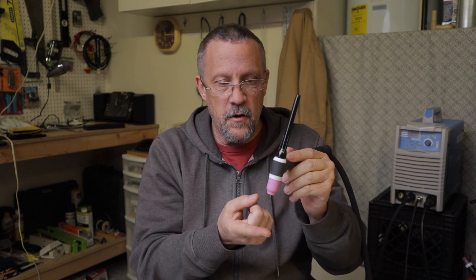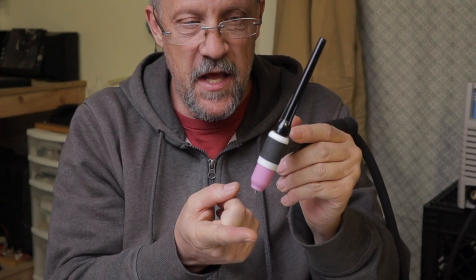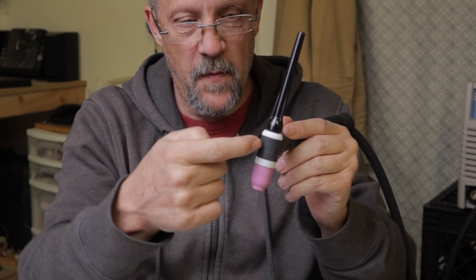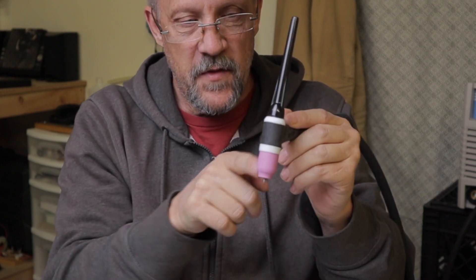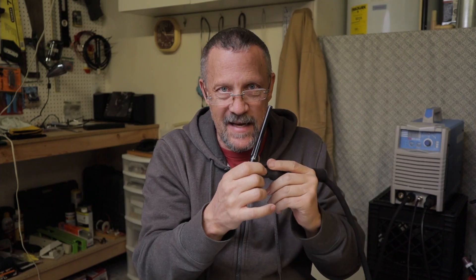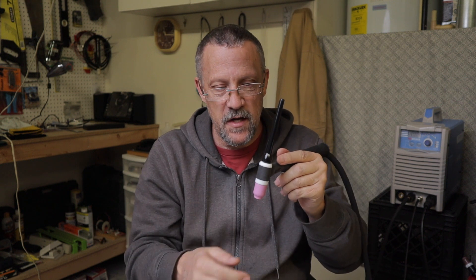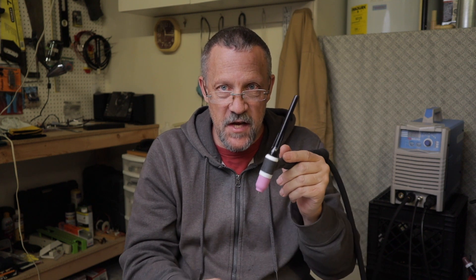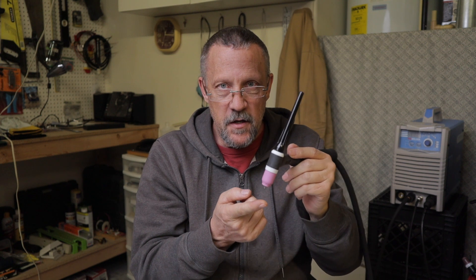What's the benefit of having a stubby kit? If you've got a longer tip where the end of your tungsten is, any movement in your hand is going to translate into a much larger movement from the pivot point at the handle. The longer that distance is to your tungsten, the more magnified any movement is going to be. So you're trying to get steady, trying to be comfortable, and trying to make a nice smooth bead. If you've got the shakes or don't have a good prop, all those movements on a standard cup setup are going to be magnified.